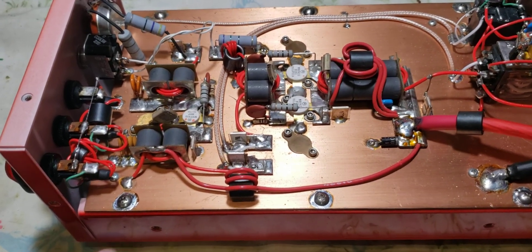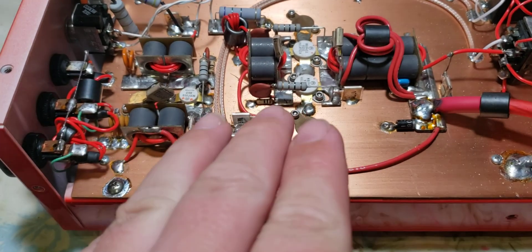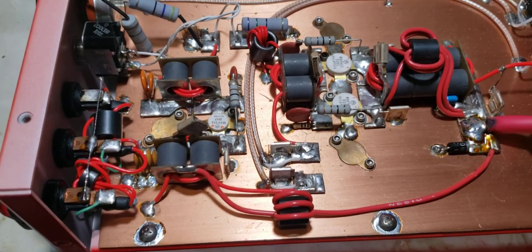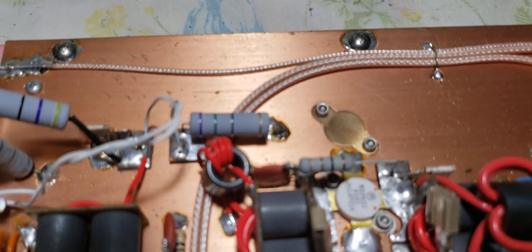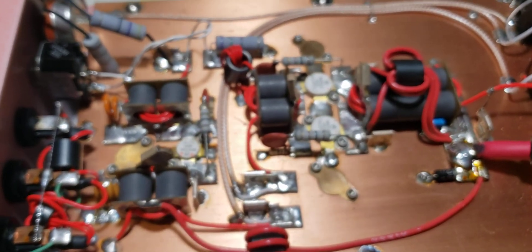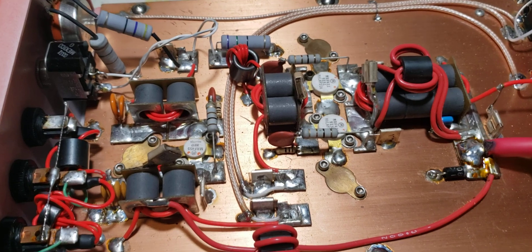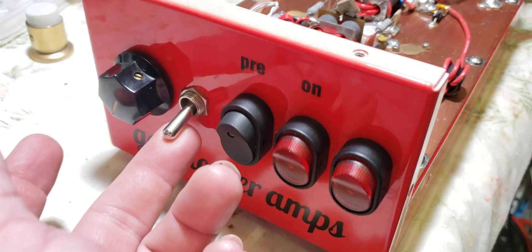Another thing: since this 455 in here is just way too strong for these two 421s, I had to add a little extra attenuation — that's that 75 ohm resistor right there. And basically since this is staged now, he was wanting to know if I could enable it so he can turn that resistor on and off. So that is what I have done with this switch right here.